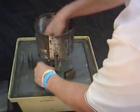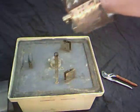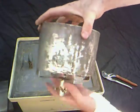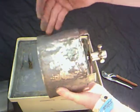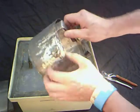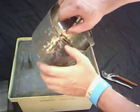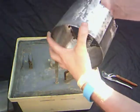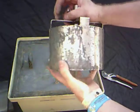All the silver is already gone off this one, but when you harvest the silver, what you can do is just flex it a little bit. That cracks the silver flake, and then you can get underneath it either with your fingers or with a screwdriver and peel off the chunks of silver flake. Don't bend too much because you want to keep it round, but just flexing it a little bit makes it a lot easier.